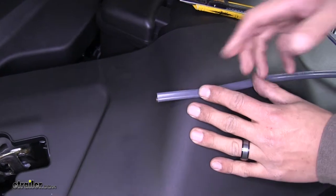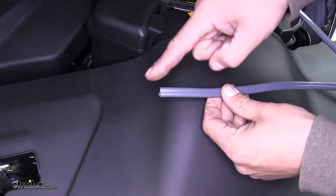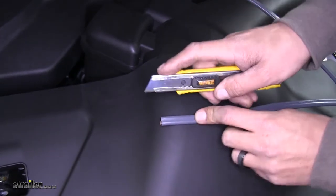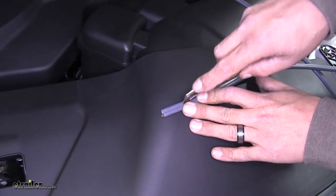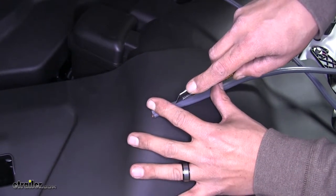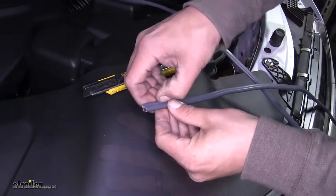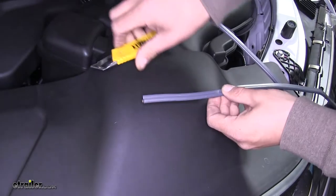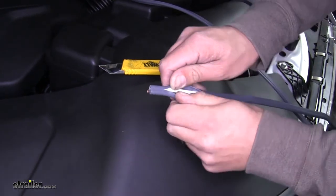Now our gray duplex wire is going to be split open again. However, this time instead of just splitting that gray section a little bit, we're going to want to go all the way back to the point where we zip tied it, splitting it open and separating the two wires. Take a razor knife and very carefully cut the gray sheathing off until we can expose the two wires. Just take your time and be careful not to damage the wire inside — do it a little bit at a time, cut a little bit, open it up, and start peeling it back.